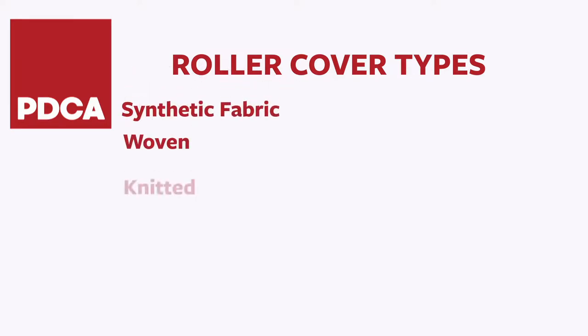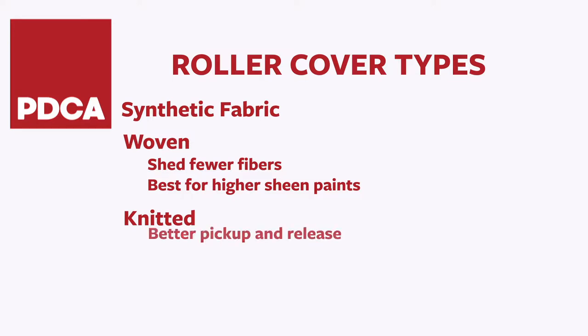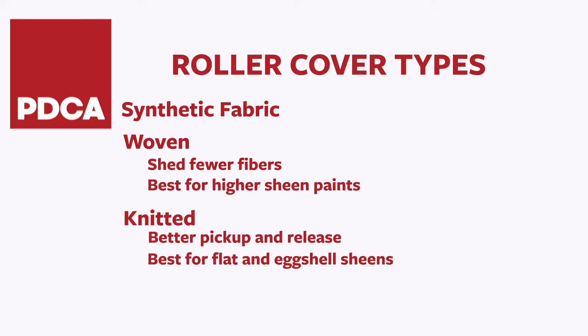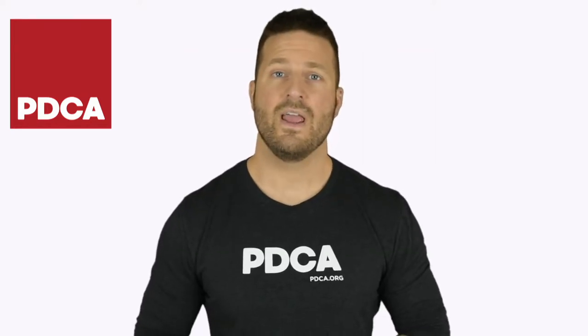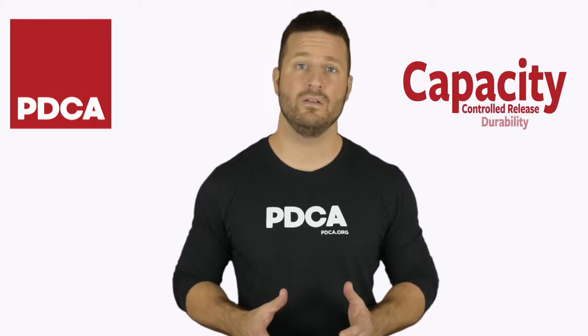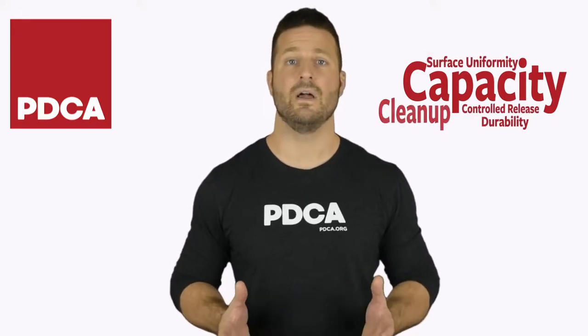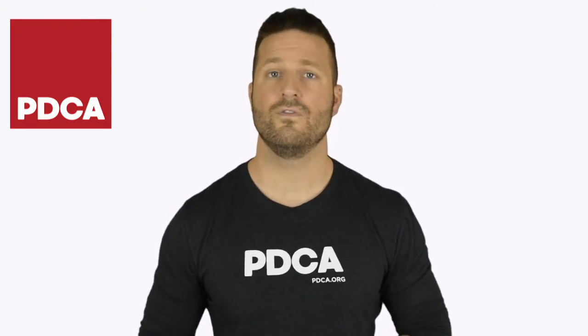Roller covers are usually a synthetic fabric that is either woven or knitted onto the core. Woven fabric will shed fewer fibers and so is great for higher sheen paints. Knitted fabrics are more productive because they'll give better pickup and release and so are best for flat and eggshell sheens. There are many different types of roller cover fabrics, and that means many different advantages to each. Greater pickup with more capacity, controlled release, durability, surface uniformity, and cleanup. Choose the cover that best allows you to balance production with the desired finish.